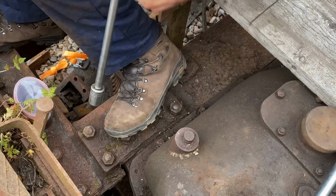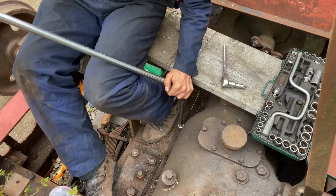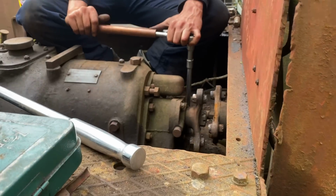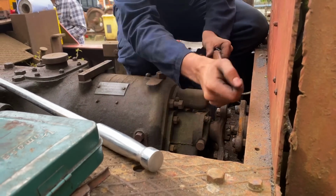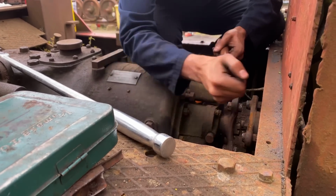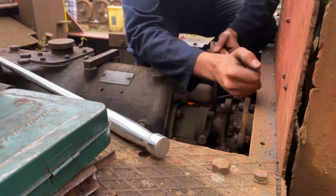None of them wanted to take a socket as they'd all rusted and expanded slightly, so every single one had to have the socket hammered on, use a breaker bar to break it loose, and then a ratchet to get it out. It's probably not been done this millennia. I'm sure that the Scrapman was very conscious of what this locomotive was going to do in the future. It's weird, isn't it, when you care about something and want to say something that's older than you.